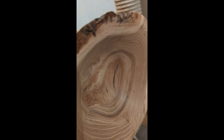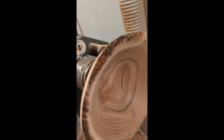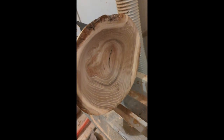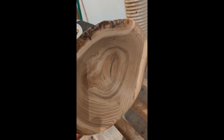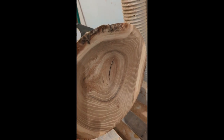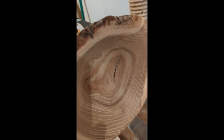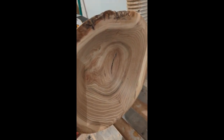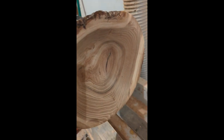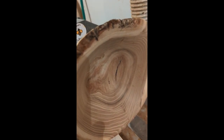I'm ready to move on. I ended up just sanding it and did not put a tool against that spot, though I did use the tool at the very bottom. At this point I've sanded with 60 grit and I want to make sure there are no lines or spots that need fixing before I move on to the next grit. You've got to spend the time. I turned this bowl in under half an hour but I've spent an hour sanding and filling the cracks — a lot more time in the finishing than in the turning.